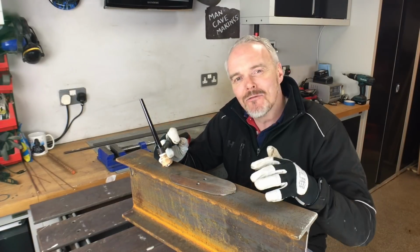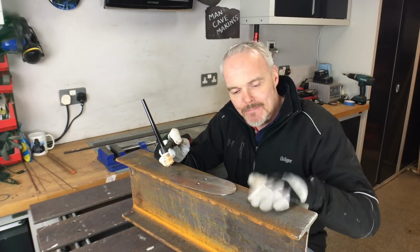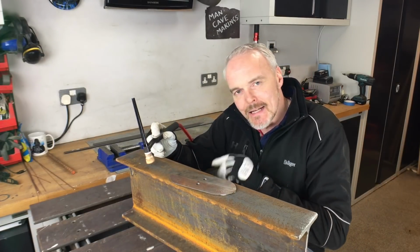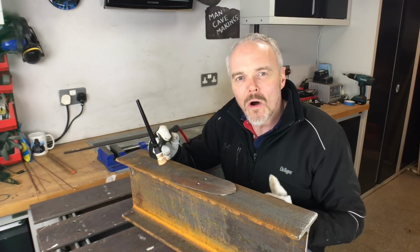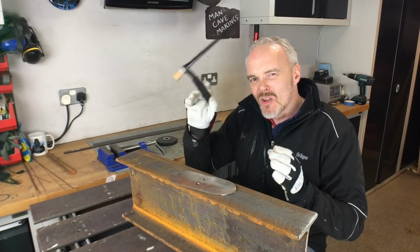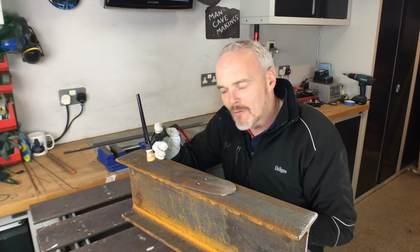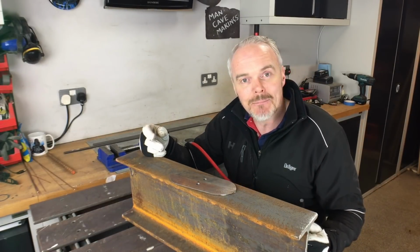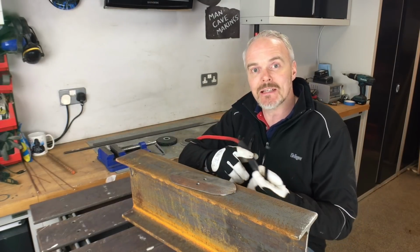But the distances involved: if you're in the UK, dig a 10p bit out and stick it on the deck there, that is the distance, that is the thickness, that you're going to try and maintain. In the US, I think a quarter or something like that is pretty similar. So again, get that down. Holding your torch like a pencil or a big crayon is perfect. And you can practice without it being in your hand, with pen, paper or whatever, and get your 10p bit out and practice. That's essentially what you need to do there.